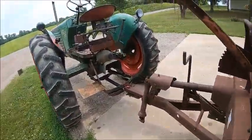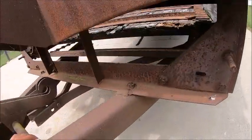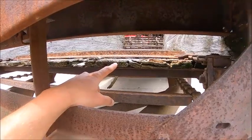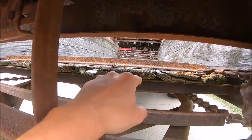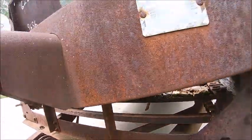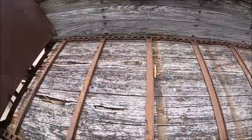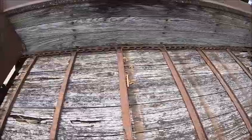And at first, when I was looking at this thing this morning before I went and looked at lumber, I thought that they had made it tongue and groove. Well, I got to looking at it better, and I managed to find an actual original joint. And all they did was make a lap joint. So that board goes over, that board goes under, and they just made an overlap. Which is nice, because Granddad's got the stuff to make that. If it was tongue and groove, I was going to have to buy stuff for his router to make tongue and groove. That was going to be about $140 worth of tooling just to make 12 boards.